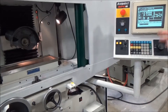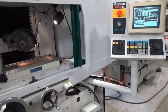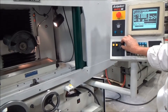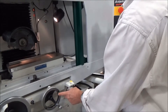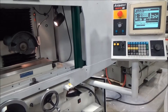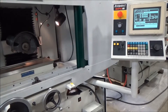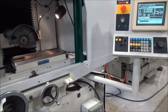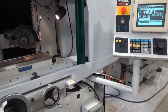You can see the jump on the wheel there — now it'll go down about three more times and that'll be about it, then it'll park itself. We can lower feed right now too while we're running. I can slow this thing way down — you can see the axes moving very little now. I'll speed it back up — you can see it take big jumps now, half inch. There's the spindle — you're getting the whole thing. Minus four, I think that might be where I'm headed. This would be the end of the program — I've got a spark-out pass coming up here. This should be sparked out here.